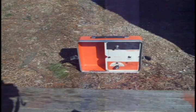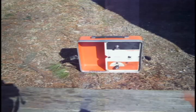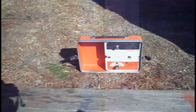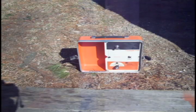Both the 480 and 480B operate at 83 kilohertz. Right now it is sitting on the ground above a power cable approximately two feet below the unit. The locator puts out a magnetic field around the metal rim around the case, and this penetrates the earth quite a distance. Through air it does about 25 feet, and some of that signal may attenuate in the earth but it should go down about 20 feet or so.